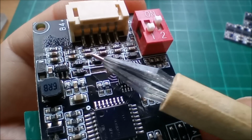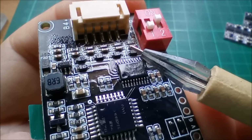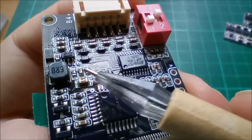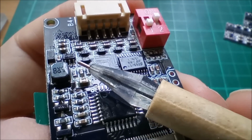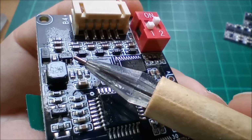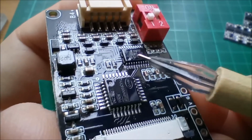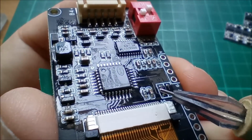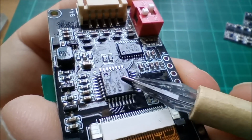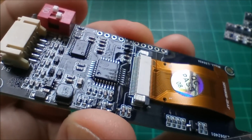But it looks to me like the cell voltages all appear here, where these capacitors and, I don't know, bypass diodes or some sort of diode there all come into this chip. So I think this is some sort of battery voltage monitor chip. It looks like there may be a buck converter here, possibly, yeah, that might be the controller chip there, 1HWG, something like that, to provide a voltage to run these controller chips, because they're not going to want 30 volts or 15 volts across there in my case. And then possibly some regulators down here. But yeah, I think this chip is doing the voltage measuring of the different cells, and then this is a microcontroller which probably has built-in LCD drive capability. But that's all that's on here.